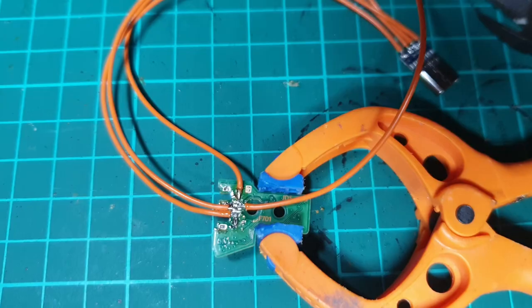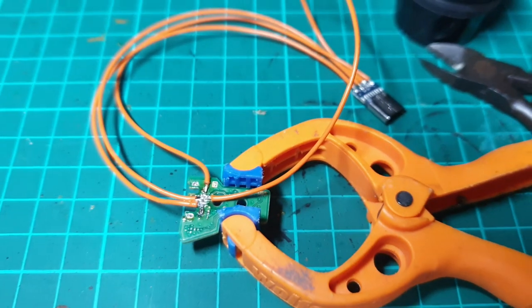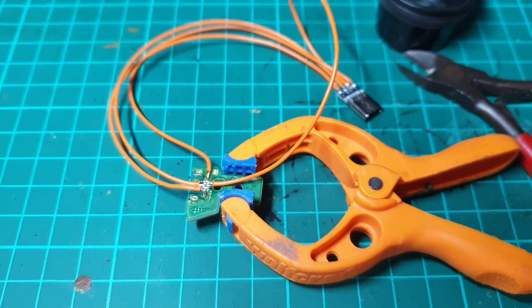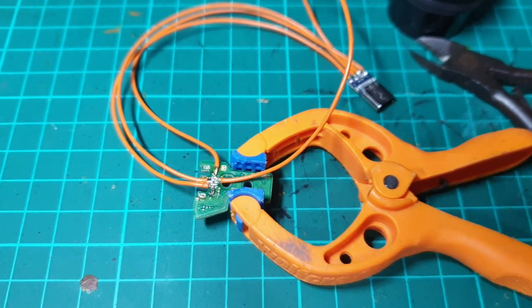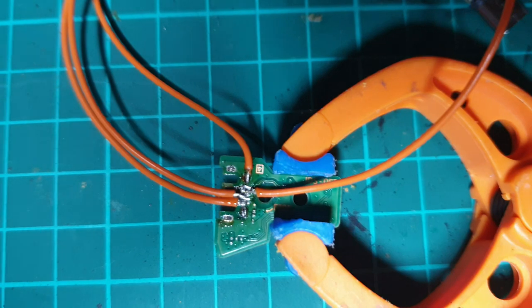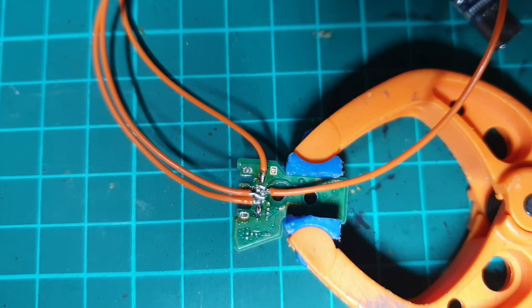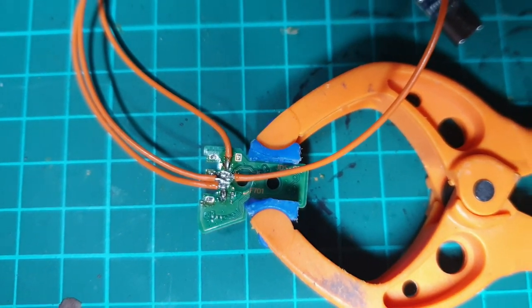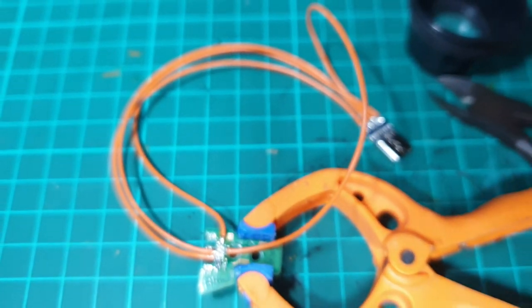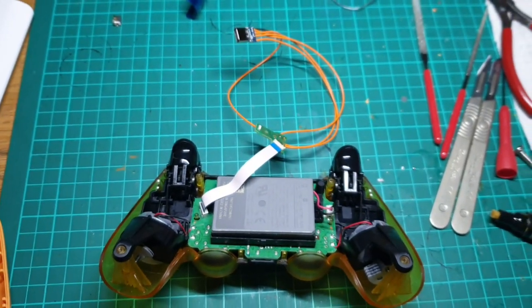Once that's done we can connect it to the USB-C board — and what is that? This is truly horrible looking and I'm quite ashamed of it. The wire I'm using is way too big for the pads on the board so it came out like this. It looks like they're all shorted together but I buzzed it out and it's all good somehow. At this key point that's actually all the electronics done. What I need to do is lash it up and test it out to see whether this abhorrent wiring is truly alright.